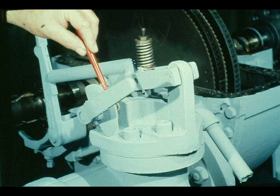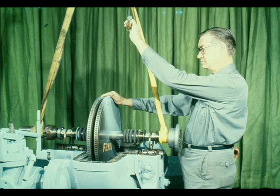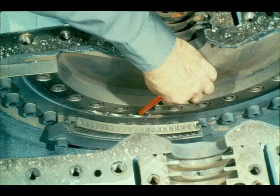The lever the workman is now pointing out is called the auxiliary resetting lever. It is used to assist in resetting the resetting lever after it has been tripped. The steam pressure against the overspeed valve often makes it very difficult to reset the resetting lever, and the auxiliary lever makes it easier. The only major remaining parts we want you to see are in the bottom of the turbine case. We will remove the rotating assembly to make it easier for you to see them. These are the nozzles, mounted in a nozzle ring in the side of the casing.